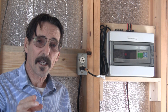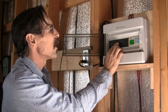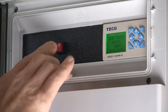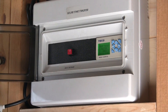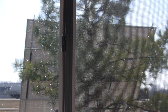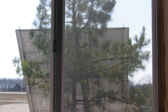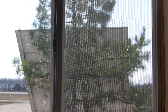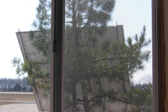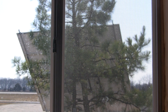In my opinion, that's a whole lot better than tracking with an eye. This is how easy it is to test the tracker outside — you just want to run it through a test. You hold the red button for 7 seconds, release it, and now you can watch the tracker start moving. It will go through all of its positions — fully east, then turn and go back fully west.